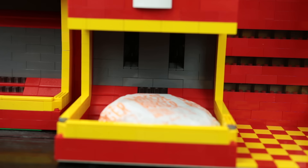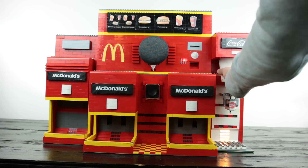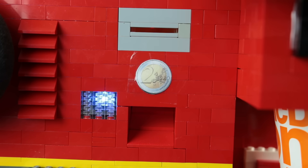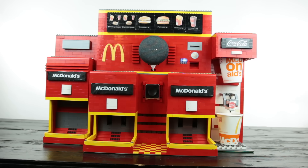So here's an example for the entire cheeseburger menu option. One cheeseburger menu please. Bulb number two turns on, bulb number one turns on, bulb number four turns on — the NXT now knows that we want three items. You can use the coin slot now. Please prepare a cup under the Coca-Cola faucet. NXT 2 is now ready to accept coins. NXT 2 sends a total of six euros. NXT 1 taps the A button on the 3DS. Google Home says back the custom phrase. NXT 2 activates the motor for cheeseburger and soda. NXT 1 activates the motor for fries.